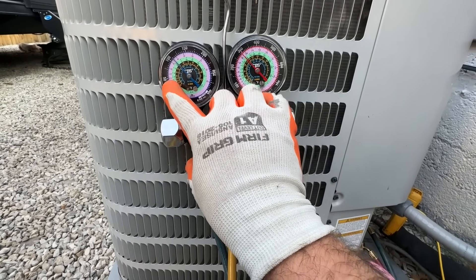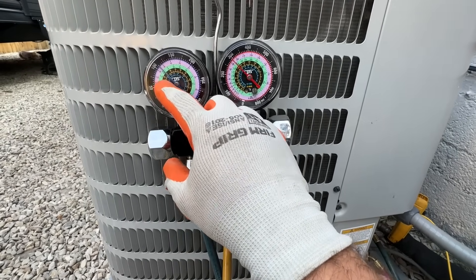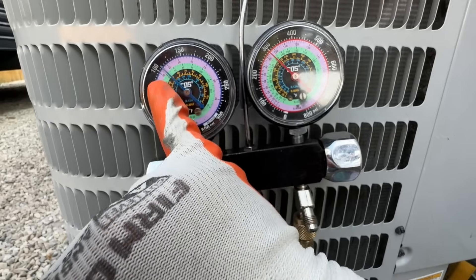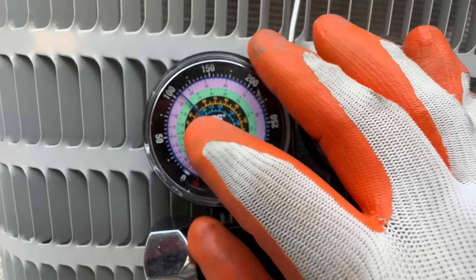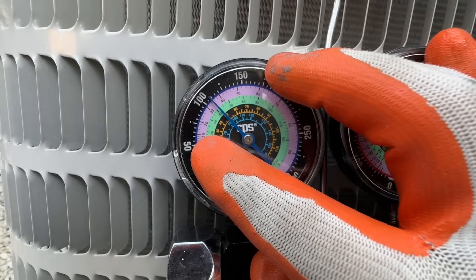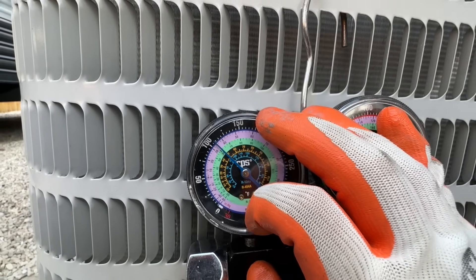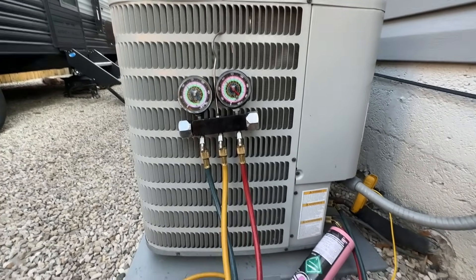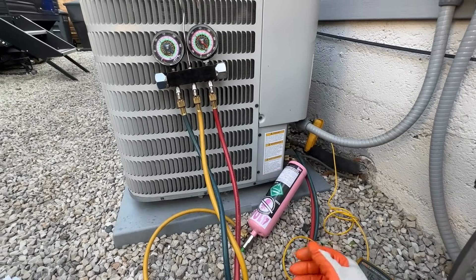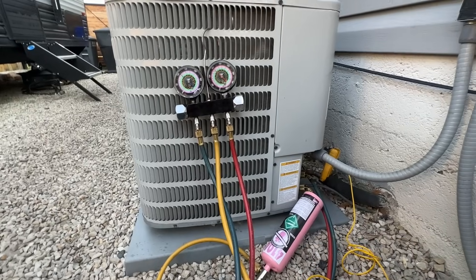With an R22 system, I've seen some as low as 50 or 40 PSI. On a hot day you want to have about 75 PSI, which should correlate to about 40–42 degrees at the evaporator coil. This temperature on the pink scale tells you what the temperature of your evaporator coil should be. With R22, 40 degrees at the evaporator coil would correlate to about 65 PSI, and for 410A, 40 degrees correlates with about 125 PSI. If you're in a situation where your coils are frozen or your line is frozen, you can do this in a pinch — get a small bottle and save a lot of money, because these companies mark up refrigerant, especially R22, like 100 times over.